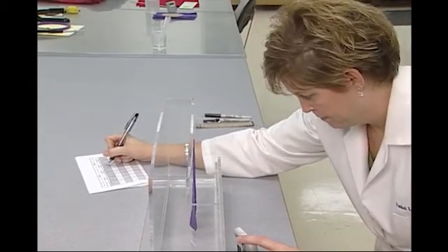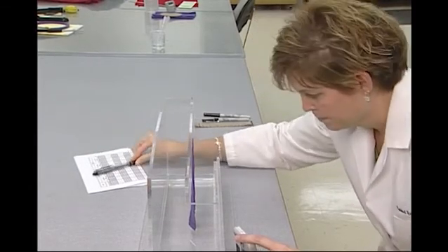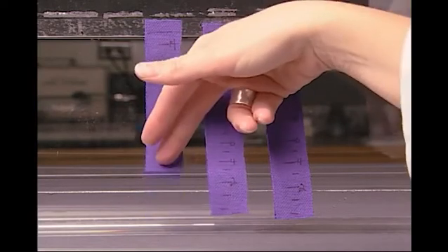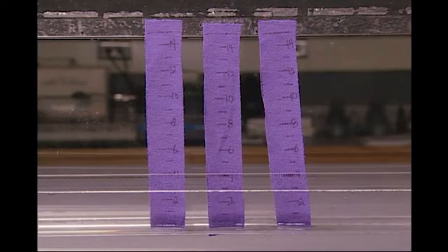When the water level is raised to reach the lower edge of the specimen, the water migration is observed. If using a multiple specimen apparatus, specimens are put into the distilled water tank at the same time. When the water migrates to the five millimeter level where the water-soluble ink is and spreads upwards along the specimen length, timing begins. When the two centimeter ink line is breached and the water-soluble ink spreads, the time is recorded.